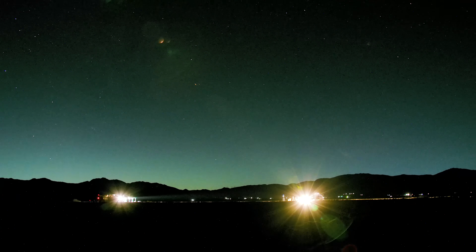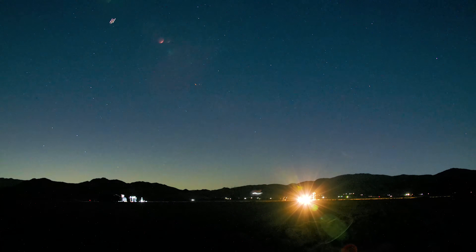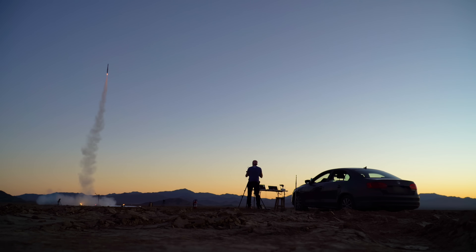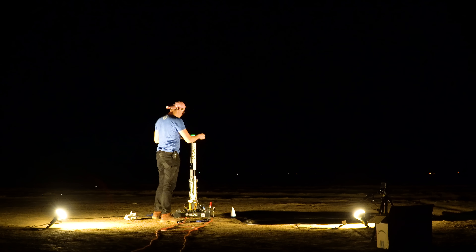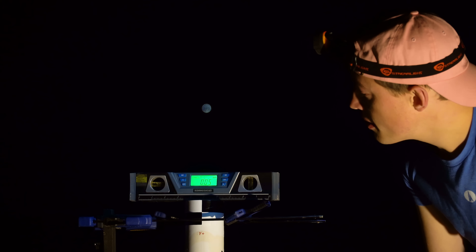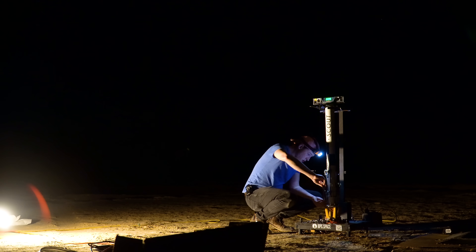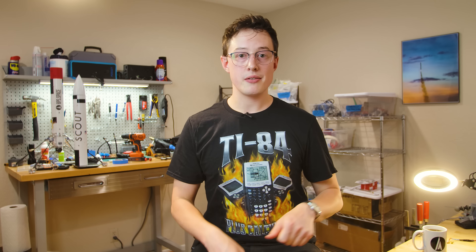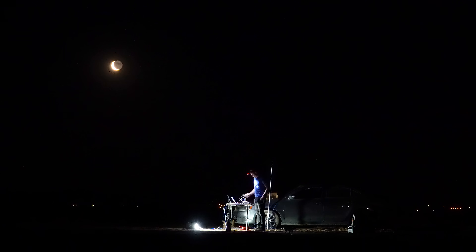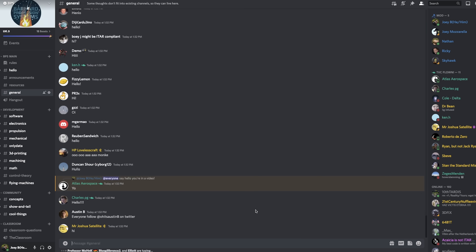I fly these rockets right before dawn because it gives us basically no wind, but it does mean that I end up setting up in the dark. This is getting a little easier every time I do it, and honestly it feels awesome to see the sky light up right before we lift off. After setting up the landing pad with cardboard, a rug, and mylar to soften the touchdown, I calibrated the launch pad. This involves a high-precision level to ensure that the rocket is truly upright. Because of how heavily we rely on inertial measurements to get position, velocity, and attitude, it's really important that we know exactly where we start and where we're pointing when we lift off. I try to level the rocket to within at least a tenth of a degree using an adjustable pad at the base. Then I set up the Patreon livestream — if you want to support this project, you can get access to all of the raw flight data, flight footage, launch livestreams, and the BPS Discord by clicking the link in the description.